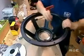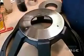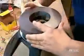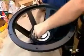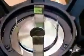They screw the front plate, the plate with the bigger hole, onto the glued surface. Then they glue the underside of the front plate and one side of a ferrite, a ceramic ring made from iron powder. After adhering the ferrite to the front plate, they apply glue to the other side of the ferrite, then flip the basket over to attach the back plate. The core fits through the large hole in the front plate. They insert shims to center it while the glue dries.